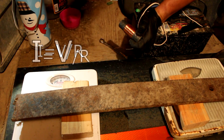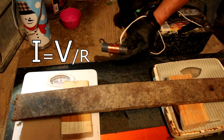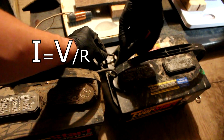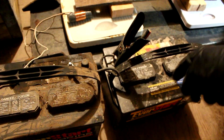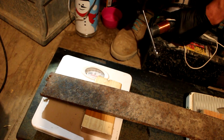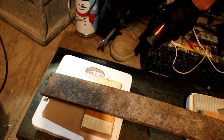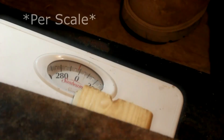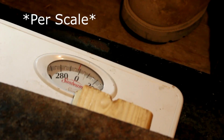I'll put the equation up here. So one thing we could do is increase the voltage — I can do that by hooking another battery up in series. Now I'll have 24 volts instead of just 12. With the added voltage, the magnet has no trouble holding onto the wrench. Now instead of roughly one pound of pull strength, I've got at least four.